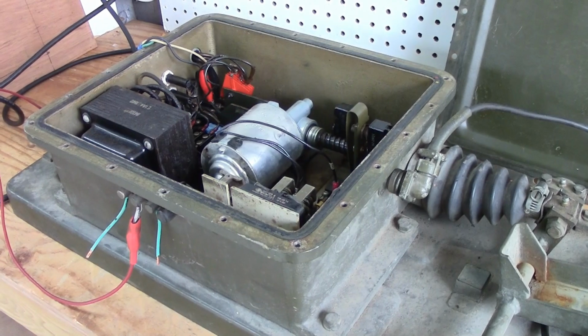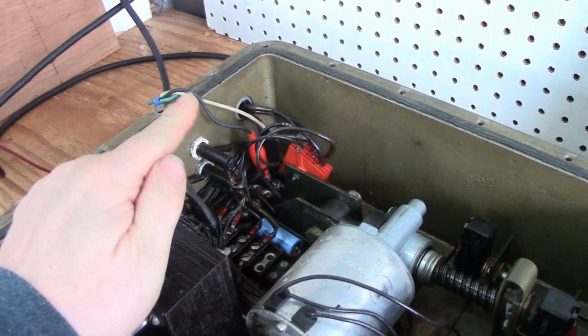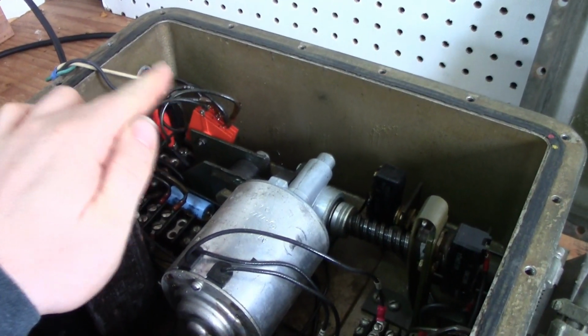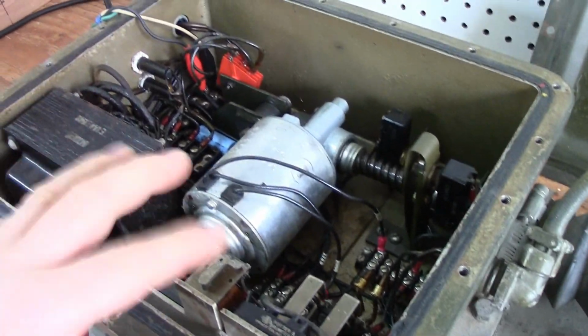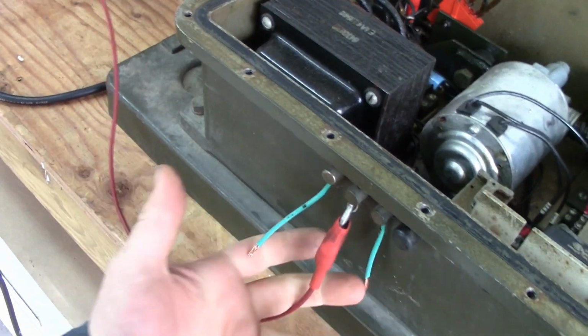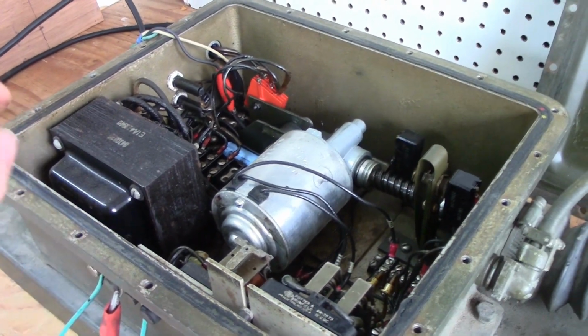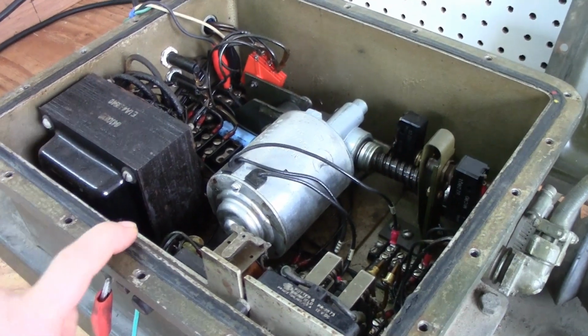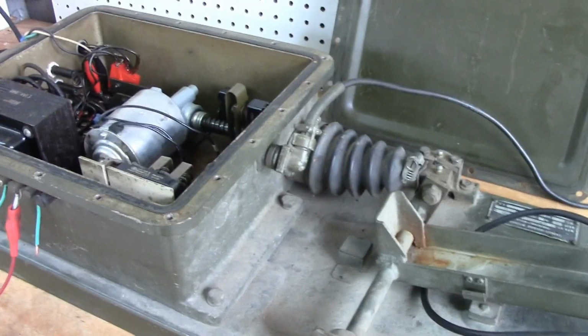Okay, cool. I think what I will do is obviously change the power connector, maybe look into changing that selenium rectifier with a more modern bridge rectifier. I don't think anything in here is going to complain too much about that. And sure, we'll still have these terminals here for raising or lowering, but what if I buy one of those cheap 2-channel wireless remote control sets off the boat from China, so then I can raise and lower from a remote control? I mean, it still doesn't answer the question, what am I going to do with it?